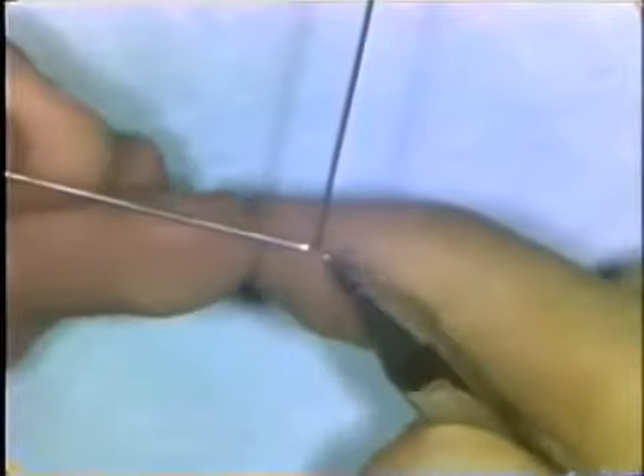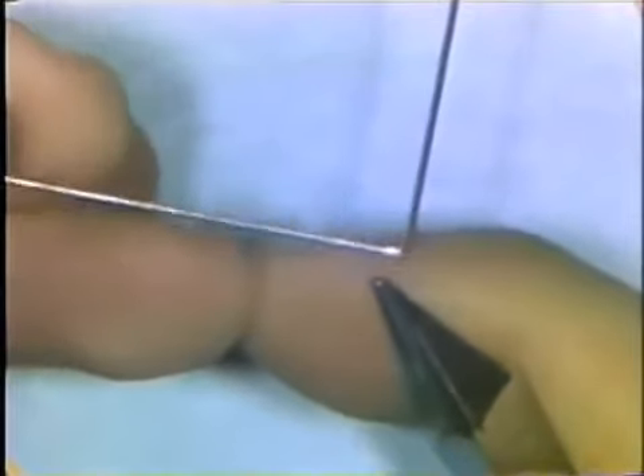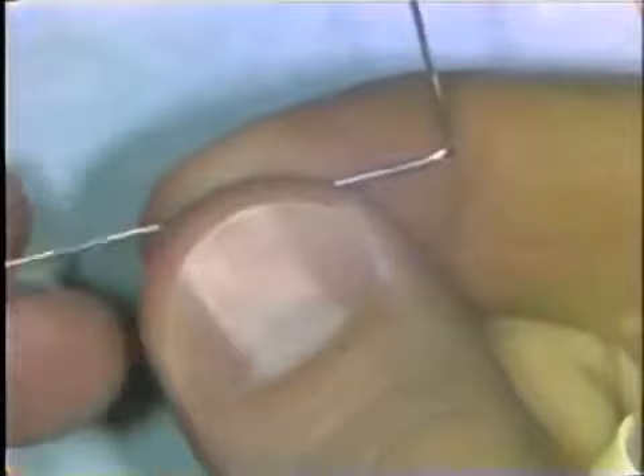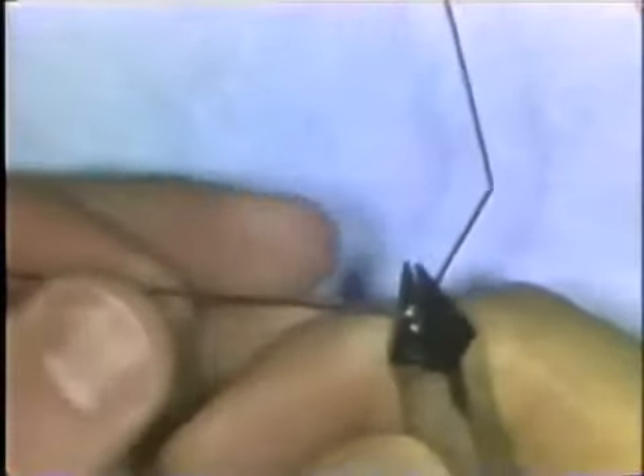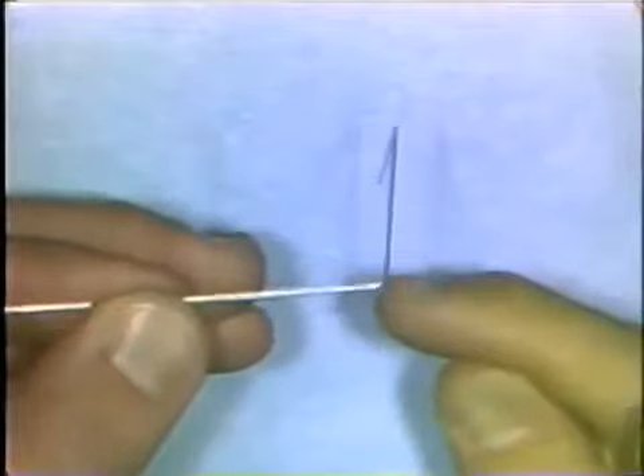You want to make sure that the bend itself is confined to a small section of the wire. There are some problems you should avoid in making right-angle bends. Don't make the bend too large — if you use too large a cross-section of the round beak of the plier, the right-angle bend will be more of a curve than a sharp bend, and you may not achieve the accuracy that you want.